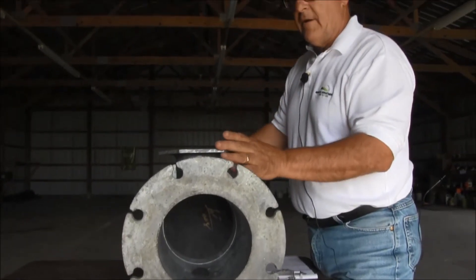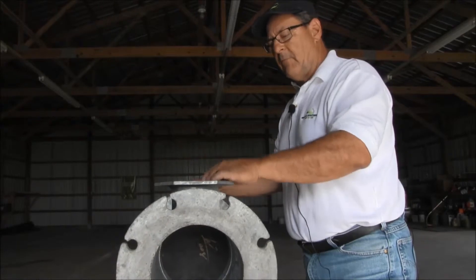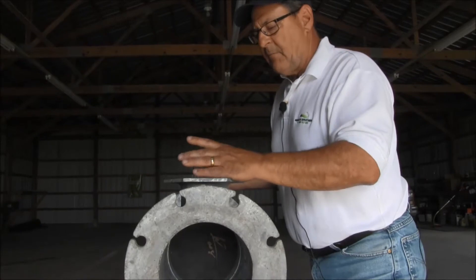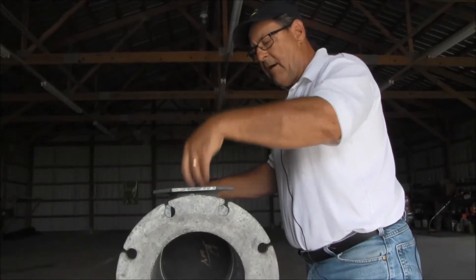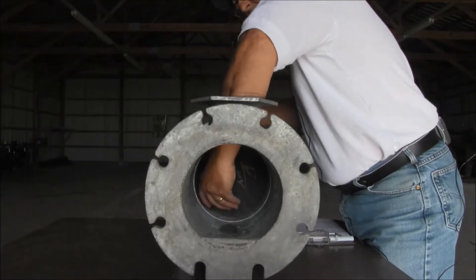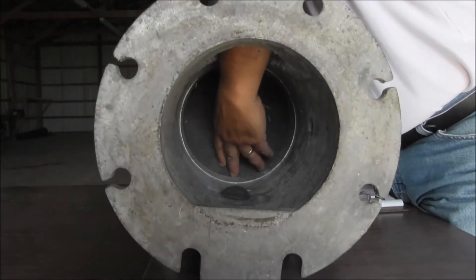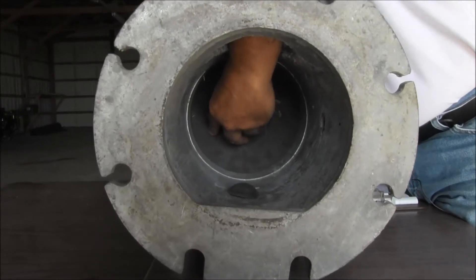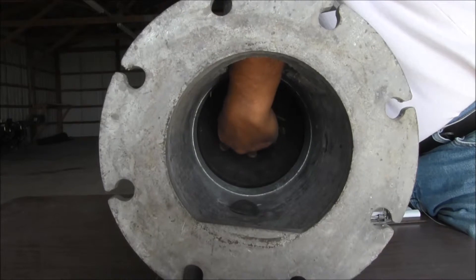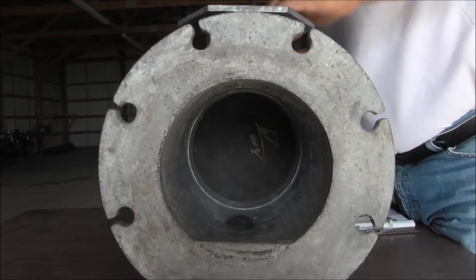When you're doing your actual inspection of the anti-pollution device, you pull your vacuum breaker off, and that works as an inspection port. With that inspection port, after you have your vacuum breaker off, you can reach your arm down into the anti-pollution device itself, and you can feel that flapper valve. You can feel if it's leaking, and the other thing is to give it a good push with your hands — it's a little bit stiff — but you give it a good push to see if it opens and closes and seals correctly.